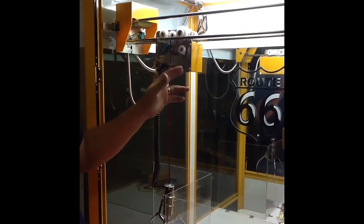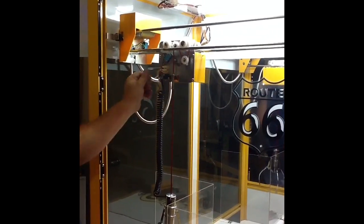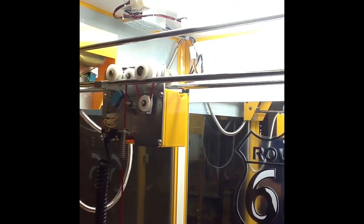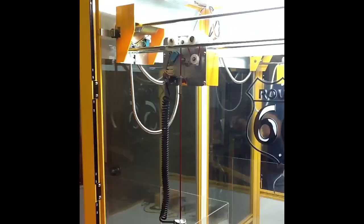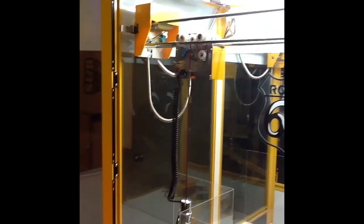During that 10 or 15 seconds, that's when you put your meter on the two leads to that motor — which is the right motor on the center car — or you can go back in the back left corner at the two studs and put your two leads in there. Turn it off, turn it back on, wait through the countdown, and in the first 15 seconds you should have 48, 50, or 52 volts. If you smell smoke — like if the motor smoked — more than likely it's a bad motor and you're going to replace it.